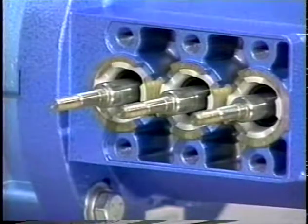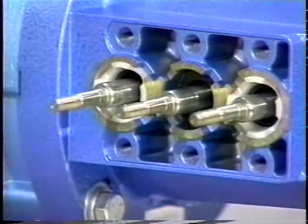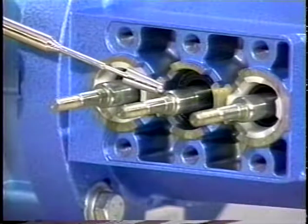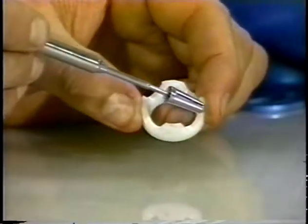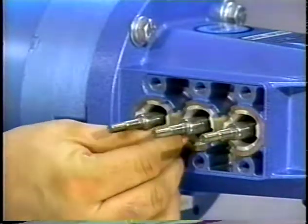Next, rotate the tab of the seal retainer to the open slot on the crankcase chamber. This is not necessary on the 4SF pumps. Then use a needle-nose pliers to pull the seal retainer from the crankcase. Examine the crankcase oil seal for any signs of deterioration. Examine the plunger rods for any deep scoring or scale buildup and replace as needed. Examine the seal retainer for any wear or damage and replace as needed. Slide the retainer over the plunger rod and place into position in the crankcase chamber with the slots lined up with those in the crankcase. On the 4SF, the holes in the seal retainer should be out and to the top and bottom and lined up with the slot in the crankcase seal chamber for best lubrication.